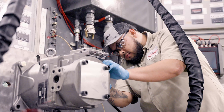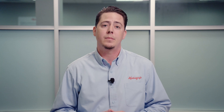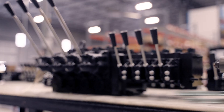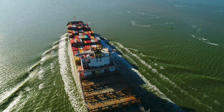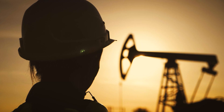They have a maximum system pressure rating of 400 bar, and an optional integrated charge pump allows the input speeds to be rated up to 2,500 rpm. These specifications allow the D1P Series pump to be a perfect fit for use with Danfoss' high-flow PVG 128 and 256 spool valves, often seen in applications and market segments including construction, marine, material handling, forestry, mining, and oil and gas.